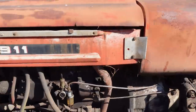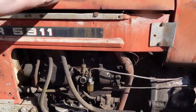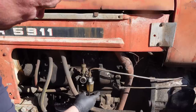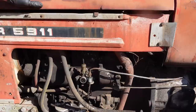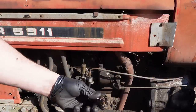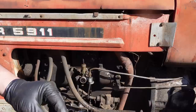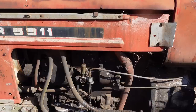Well, I'm not going to play with the valves. The next thing is to get some fuel up around it. You can see this thing here, I'll take that off. So, watching now. Crack this over there when we picked her up, but that's just all water. Bit of a gauze there, it's just completely blocked. As you can see, that's still water coming out of the tank. May have to fix this kink here so she gets a full flow of diesel, but probably drain that tank